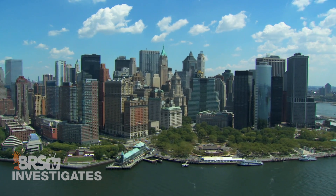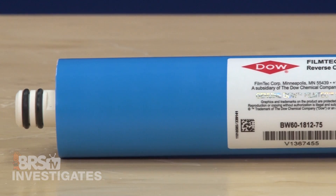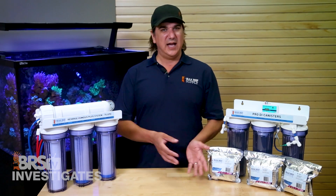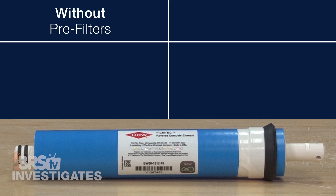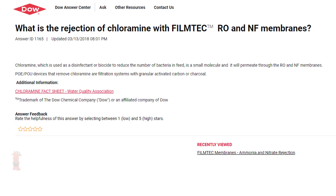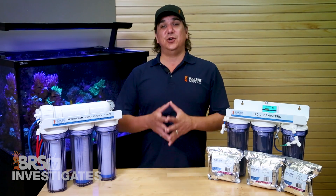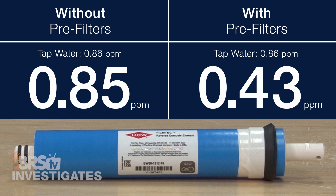If you're one of likely a majority of large city water users with chloramines, some ammonia will make it past carbon blocks — so will a standard RO membrane remove it? We'll look at this from two angles: an RO membrane without pre-filters, which will be dealing with intact chloramines, and after carbon blocks where the chloramine has been split and ammonia is largely free. Without sediment filter or carbon blocks, tap water ammonia was 0.86 and after the membrane it was 0.85 — basically zero effect. Dow clearly states that chloramine is a small molecule that will permeate through RO and NF membranes. However, with a standard pre-filter array, ammonia drops from 0.86 to 0.43 — about half.